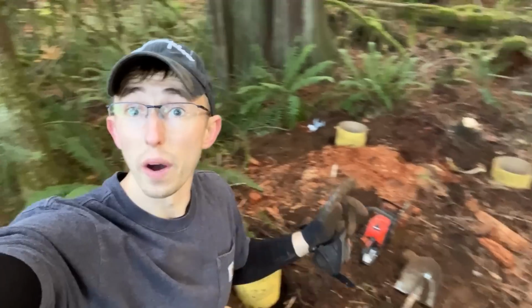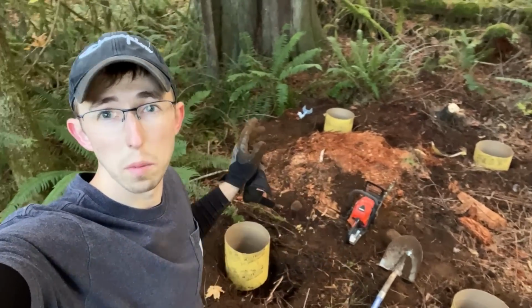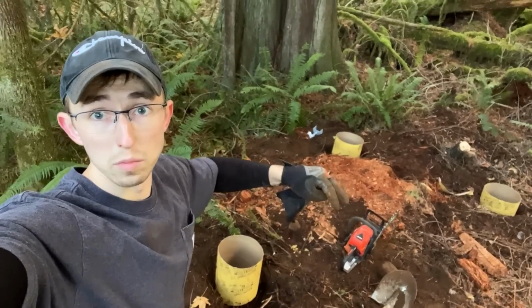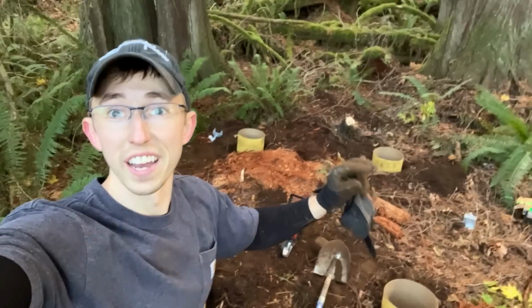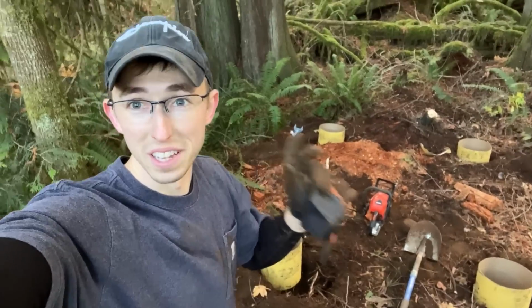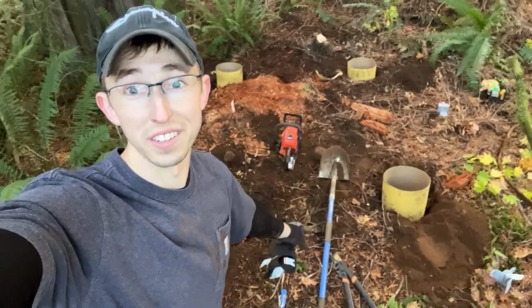As for the width placements, I place them about 60 inches, so 5 feet apart this way. So when I'm setting the runners, they'll hang a little bit over and a little bit over this way. They'll also run long this way, so there'll be a little bit of a platform to stand on before you actually enter the sauna.